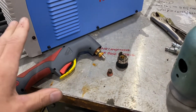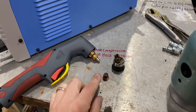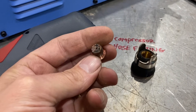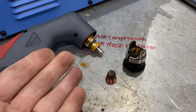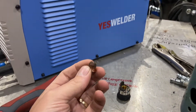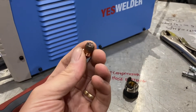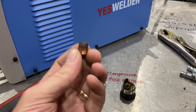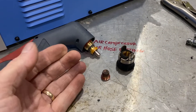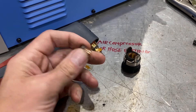If this is your first time using a plasma cutter, one thing you should know is that the tips on the plasma cutting torch are consumable items. They will wear out the more you cut, and when they wear out, you'll lose your ability to make a nice clean cut. Whatever plasma cutter you buy, make sure consumables are available for it so you can get extras when they wear out. They're usually pretty cheap — I haven't looked up these specific ones, but I imagine they're reasonably priced.